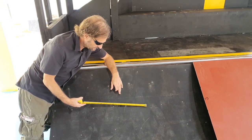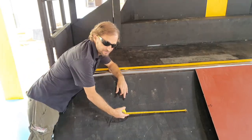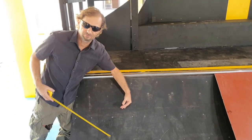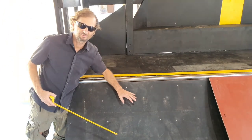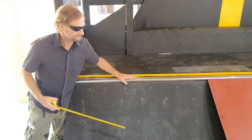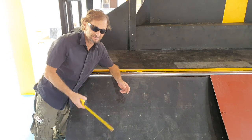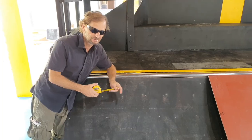And we pretty much got it. This one's 8 inches, this one's 6, this one's about 9. But anyway, you want to try to get 8 inches across on each 2x4 framing, at least for the first layer of plywood, because it's a thicker wood. It really has to stick there and bend there. And then again, the middle one, you don't need as many, and you probably don't want as many on the top one either, because you're going to be skating, and more screws is more perforations on the surface.